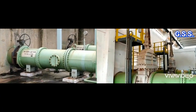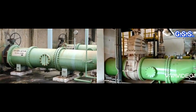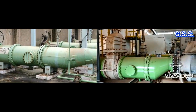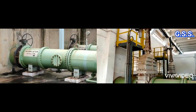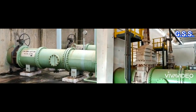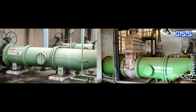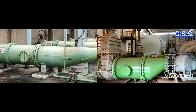Number one: straight length requirement at pump suction. As per Hydraulic Institute Standard of America, minimum straight length at pump suction should be 5 times of suction line size, which includes full open valve, strainer and reducer. In both cases, 5D straight length is there before pump suction.